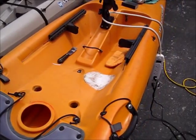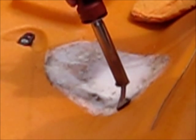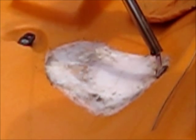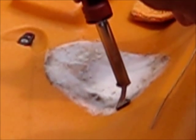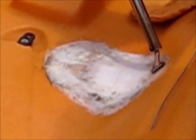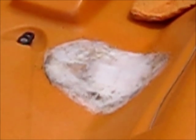Alright guys, this is a pretty big process. I'm at the point where I'm applying layers and grabbing material from what's yellow and white at the same time, trying to melt it and smear it all into one unit without much of a lip. You want to melt the yellow and the white portion at the same time with the tip right on the line, push it in a little and then keep moving. You're going to want to make sure you have some time set aside — this is not something you want to rush. It's not the greatest looking patch at all.